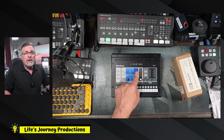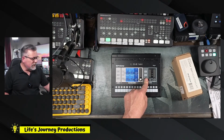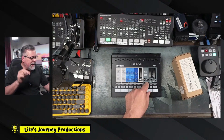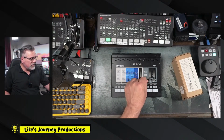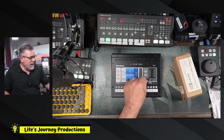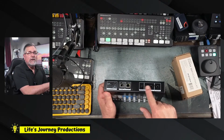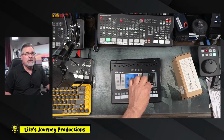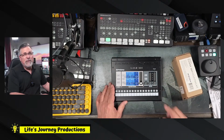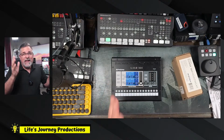So you have a limiter, and again, the pan knob and then the volume knob. And then over here gives you the ability to control your aux input. That's that 3.5 jack on the back. So you could raise or lower your click track. You could mono it. You can select it. I can also send out a master right and left. That's these 2 right here. So I can adjust that master volume. And then here is my headphone preamp. And that headphone preamp has plenty of dB, even for people that are losing their hearing.